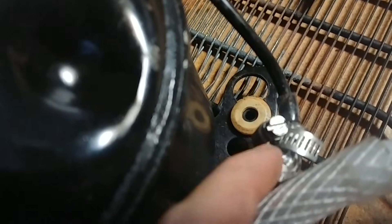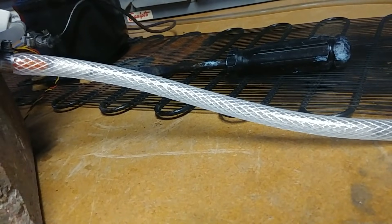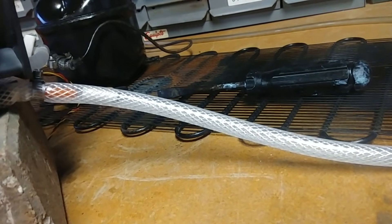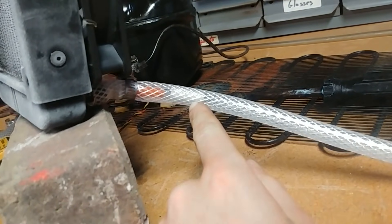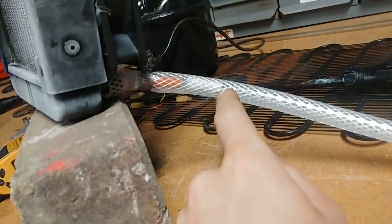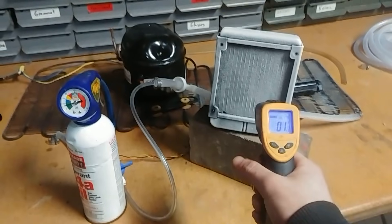That's why I put so many brackets on it so it didn't explode — you can see it's already puffing up. My best guess as to why the other hose exploded: one, it was not rated for the pressure; and two, there were actually little pieces of rust inside this radiator because I accidentally used it for water in the past. To fix that, I put a small piece of filter paper from a high-pressure PCP pump to block all the little remnants from hitting the tiny hole, clogging it up, and building more pressure than the system can handle.